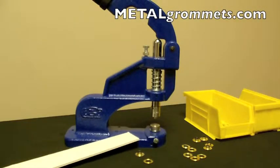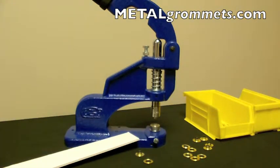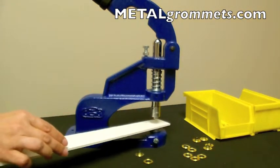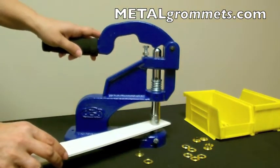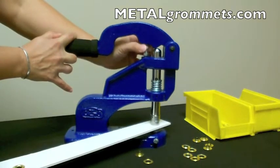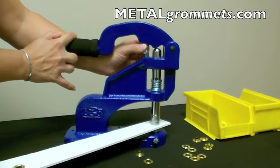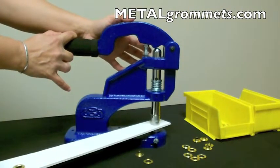To figure out the proper height for your stop screw, a few tests will be needed, so be sure to have some scrap material on hand. With your dies attached, place your material — in my case a piece of foam core — between the dies and lower the handle. When the dies meet the board, raise your stop screw to the bottom of the handle like this. Be sure that the screw meets the handle, then lock it with the nut.